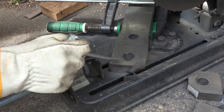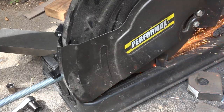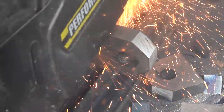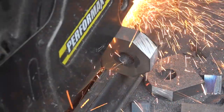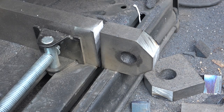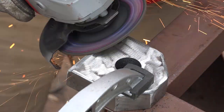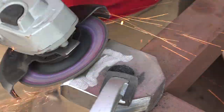I started by cutting the 45 degree cuts on both corners, which gives the shackle and whatever it's connected to clearance to swing past the corner. Once those are cut, I could swing the fence back to square, stand the blank up, and separate the mount. Each cut on the saw took about 45 seconds, and I ended up using most of the cutoff wheel — it's pretty small now. The last bit of work was done with an angle grinder with a flap wheel to grind the sharp corners off and to grind the welding bevels on the bottom.